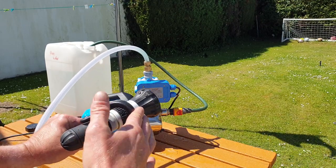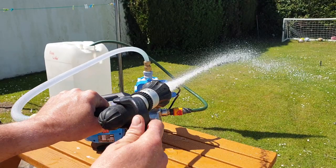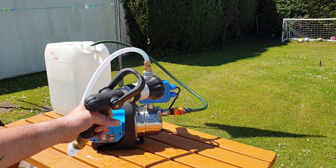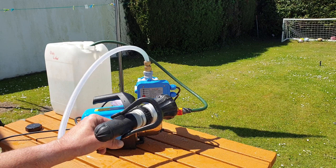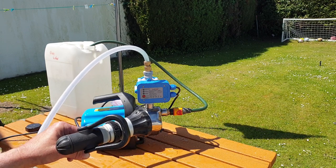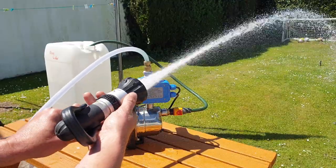A very good safety tip when using any electronic mains 220-volt pump: always use an RCD to protect yourself against accidental electric shock. This pump puts out about 65 psi.